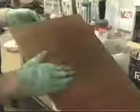When that dries for a couple days, then the recipe calls for a coat of shellac, which when that's dry gets rubbed off with 3/0 steel wool. Then we put on a glaze. Burnt umber is the color, and it's in a dispersion oil, so you apply it to the surface and then you rub it in. When that's dry, the final coats of polyurethane can go on.